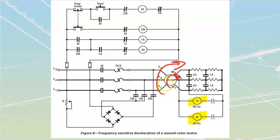The more that the rotor is being lapped by the stator field, the higher that value of frequency. So in other words, at startup, I'm going to have a higher frequency inside of my rotor, and later on it's going to start slowing down and dropping out. We'll see that applied through all of these over here. Once again, we'll carry our power through. We're going to carry power up to all of these